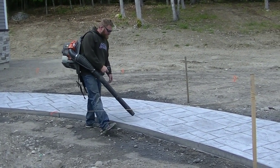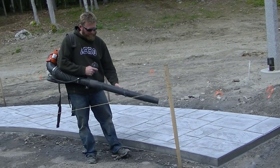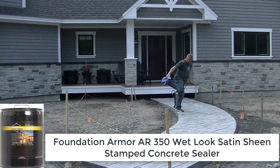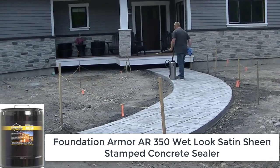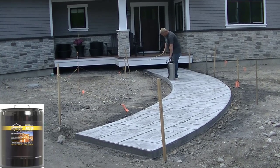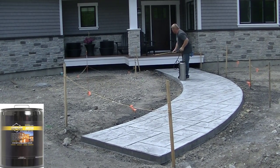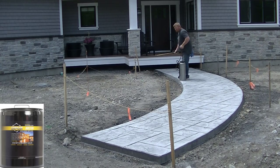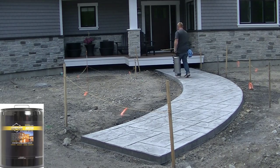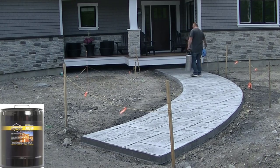You can see he's not walking on the concrete if he doesn't have to. Once it's all blown off and ready to seal, we use a solvent-based acrylic sealer from Foundation Armor — the AR 350. That's the one I recommend, and there'll be a link for it in the description. You can use it on stamped concrete, pavers, and a bunch of other things. We also use a stainless steel sprayer because the solvents in these sealers will eat away the seals on a cheap sprayer. That stainless steel sprayer you can use over and over — just clean it out with acetone or xylene after each job.